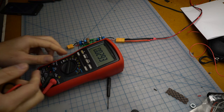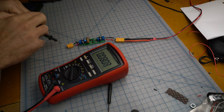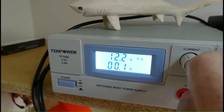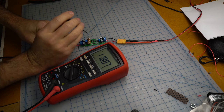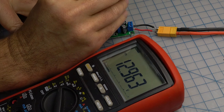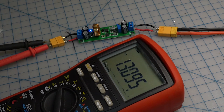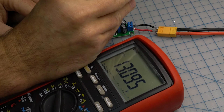We'll bring in the voltmeter. We're getting 8.5 volts but on my bench I'm actually outputting 12.2. We put this up to what a car will be - if you test your car when it's running it should be 14.8. So it's 14.8 coming in, let's tweak that up. We're at 13.1 - I'm not fully trusting this device for the advertised eight amps, but we'll see.